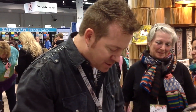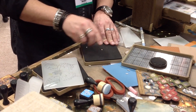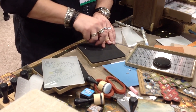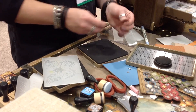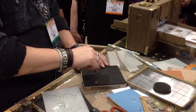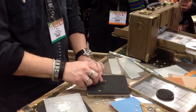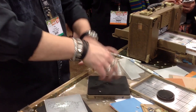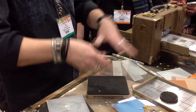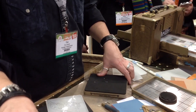So let's cut this shape. Let's clean this out. We've got this die. Never do this to your dies — always clean that. See all this stuff I'm picking out? Not good for your dies. The reason is it doesn't matter what the foam looks like when you pick this out — you can dig out the foam and it doesn't damage your die. What's going to happen is if you continue to cut and that material continues to compress inside there, it's going to create so much pressure that it's going to pop the die off the base. So if you ever have one of those dies that's not stuck and it's puffed right off the base, that's why.